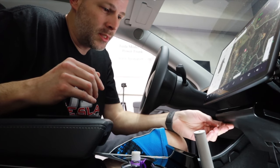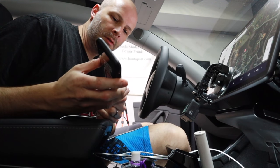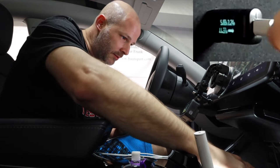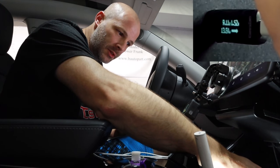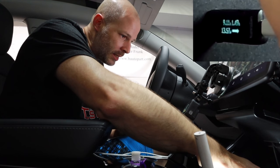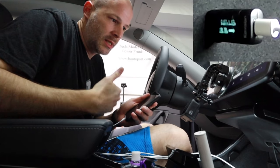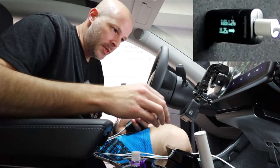I'm going to plug this into the USB-C device. What it shows on the screen is five volts — nothing is coming through the device yet because we don't have anything plugged in. Now I'm going to plug this into my iPhone. As soon as we plug it in, it's charging. Now you can see on this device that we're getting nine volts and 13 watts. My phone is about 57% charged right now, so I wonder if it would be different if it was fully dead.